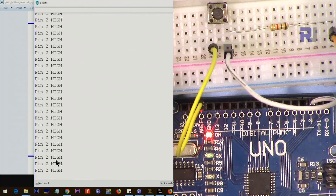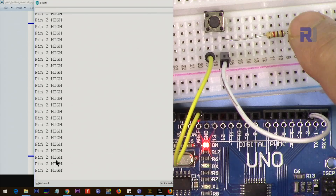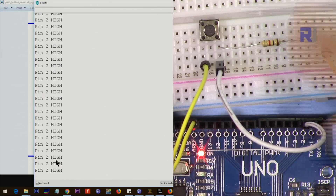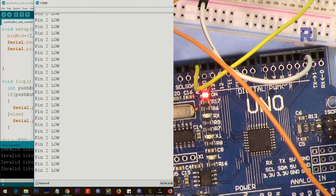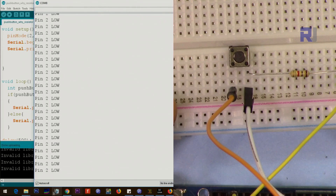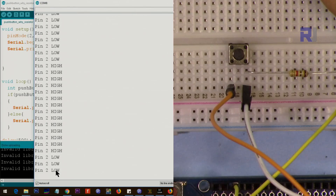Note that if you use a very large resistor like 10 megaohm, it might not have any effect — it's like an open circuit. But anything bigger than 300 ohms: 1k, 10k, 20k, or even 100k ohm will work fine. Now I've connected pin 2 via resistor to ground, and the other side of the push button is connected to 5 volts. By default it reads low; when I push it, it becomes high with no noise or interference. When I release it, it goes low again — the resistor prevents any noise from changing it.